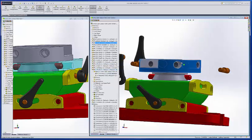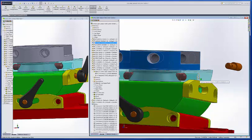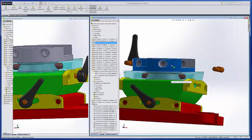This thing can still rotate around. What happens here is when you're getting this set, you set it in place. Let me get the upper holder here again. What you'll do is rotate this to get it where you want it, and then there will be some set screws that fit in this threaded hole that push against these plugs, which in return keeps this from rotating. Those tapered surfaces lock that thing in, so this piece won't rotate around anymore. That's how that all goes together.